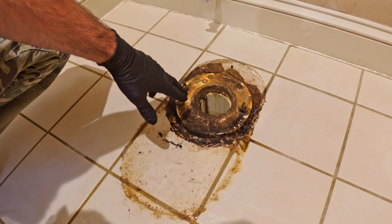I do not have any wax seal currently involved at all, so I will have to take it off. But one of the big things is that it needs to fit, and you're going to want to mark it so that you know it's straight and level. I've marked my center line of the toilet and center line of the space so that when the toilet is put down it's going to be as even as possible and not look like it's off at an angle. I've also marked my edges with just some tape.